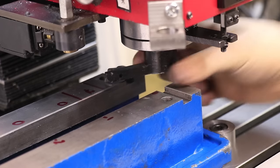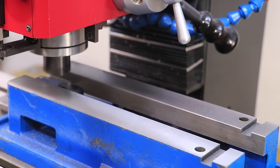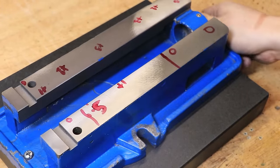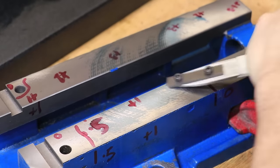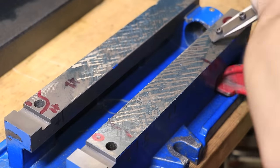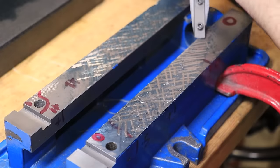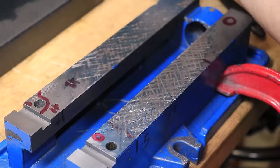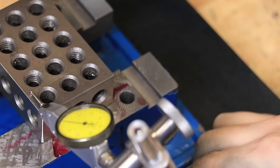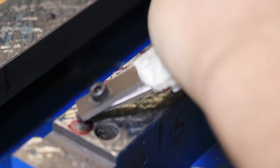Because scraping 20 microns is a lot of work, I'll fly cut it on the milling machine to hopefully get it a little more level — and as it turns out that made it a lot worse. I'm sure there were a few factors, but overall I've made it a much bigger job for myself. Scraping parallel and level was a lot more time consuming and difficult than simply scraping it flat. Because the surface wasn't parallel, I had to mark out which high spots were too high and scrape only those ones to make the part parallel — it's not too difficult but it is really time consuming.